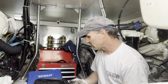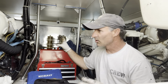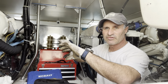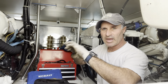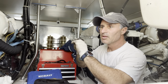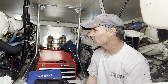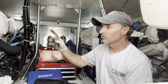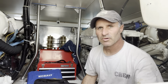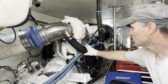The mixing elbow — I think I showed it to you when I was working on those Perkins diesels. The exhaust, which is very hot, mixes in a stainless steel mixing elbow, and that's what cools it down. It's called a wet exhaust — the exhaust and water all mix together and then go outside the boat. That's what a wet exhaust is, and that's a break point here.